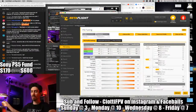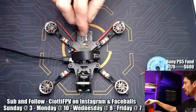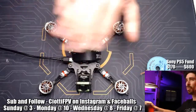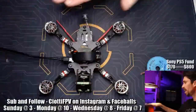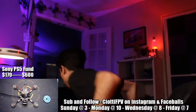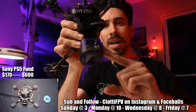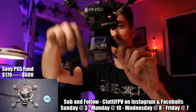This rig that we're working on here is pretty similar to a racing rig, right? The battery is going to be right in the middle. What we're talking about here is the ratio of weight on the roll axis left to right versus the pitch axis front to rear. A 5-inch freestyle rig has a huge discrepancy between those two axes, right? Because you've got an 80-gram camera way forward. This is the center line, and that camera is way forward of the center line.